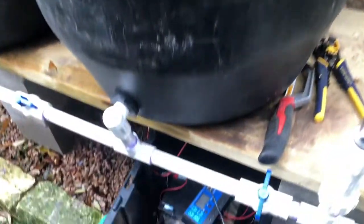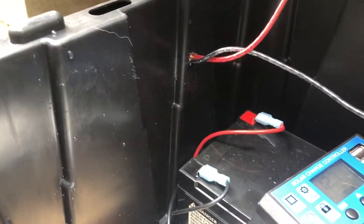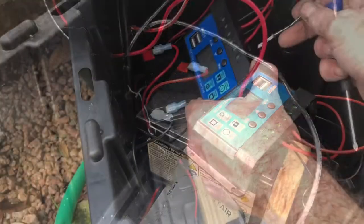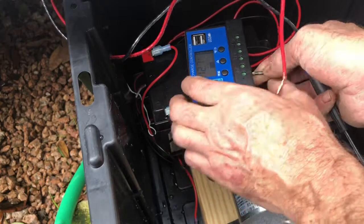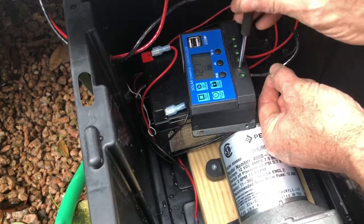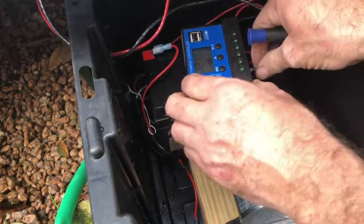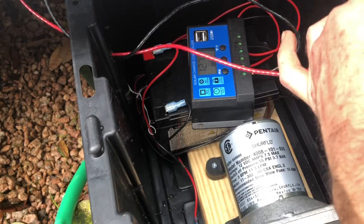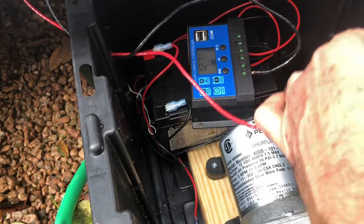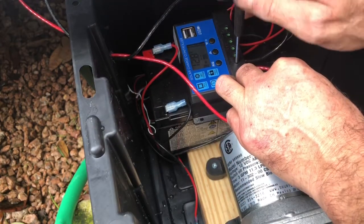The wires just come straight down to your water pump and you hook them into your control box. I have another video on how to make one of these — I'll put a link just above. You should already have your battery and your water pump connected to your solar charger, so now we're just going to go ahead and wire in the solar panel. The solar controller I used for this project was an inexpensive one from Amazon — it's a 20 amp charge controller, it cost about $12, and I'll put a link in the video description.